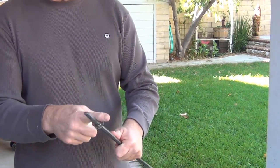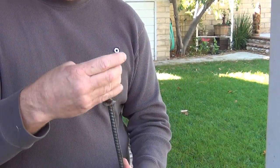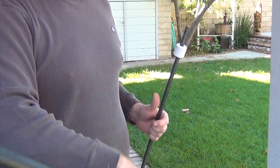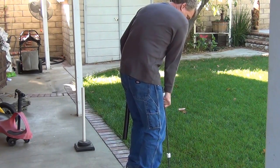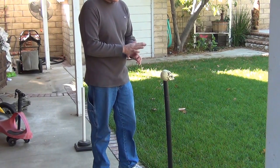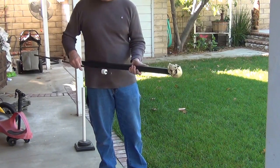I welded a washer here and a washer down here. Slip that on, weld it, slip this on. The top ones can be a little bit of a pain, but what that does is — because these guys wobble — they'll fit inside the EMT really nice. Stick this in grass really nice. The PVC caps will self-center themselves on there so you don't get any rattling. When you shove this into the ground really good, it holds these things really nice. And again, it's all about the storage.